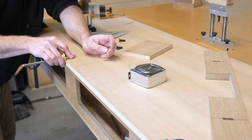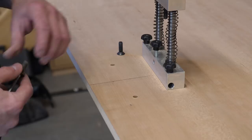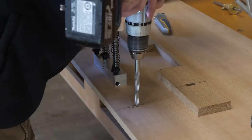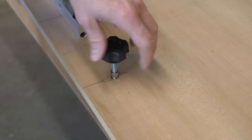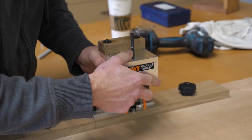I cut out a new large base and mark a reference line to help locate the two holes needed to attach the jig. I drill the two holes and reattach the springy up-and-down part of the jig. I also cut out a fence with a special notch to fit around the base, and mark and drill for a couple of threaded inserts that will be used with star knobs to hold the fence down. Hey, look at that — it actually works!